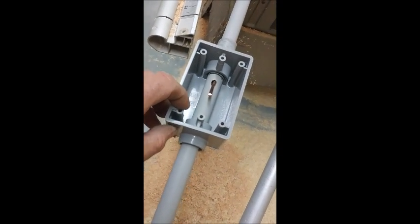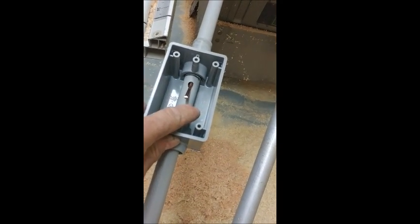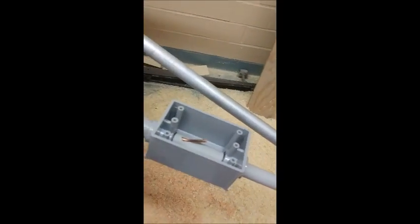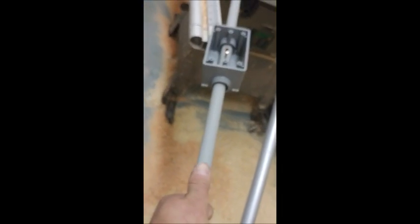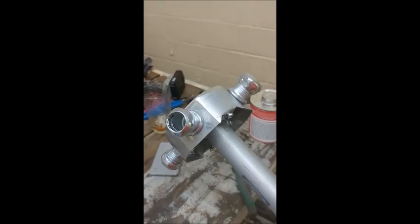Inside the box I'm going to drill a couple of holes in the bottom — one over here and one over here. I'll bring my coax into one and my ground wire out from the braided side of the coax to ground to my ground plane. To get 103 inches, you can cut 17 inches off the end, saving your bell end to run through the box like I've done, and that gives you plenty of room to put 103 inches of copper in your mast. This is just going to slip down inside of my one inch EMT, and the four little half inch connectors are going to be where my ground planes come out.